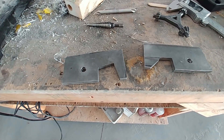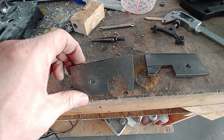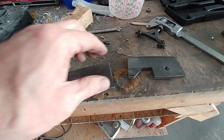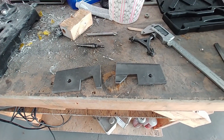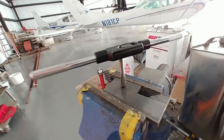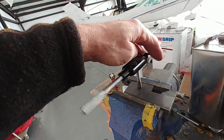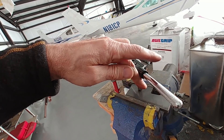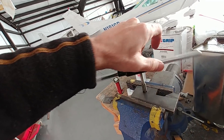Welcome back. I'm still working on the replacement of the aileron cables to use sleeved cables. These two plates I had cut from 4130 steel up at Brit's, and the holes in them need to be tapped so they can accept the cable adjusters, which allows you to tighten the cable if necessary — which I'm probably going to need to do.